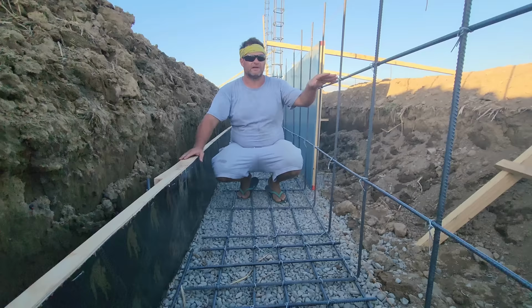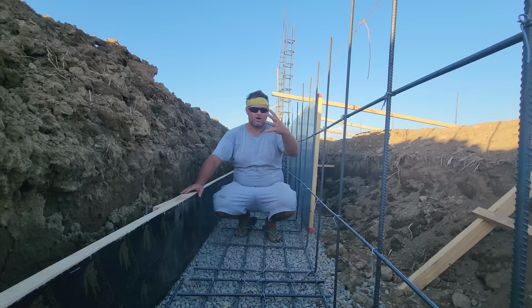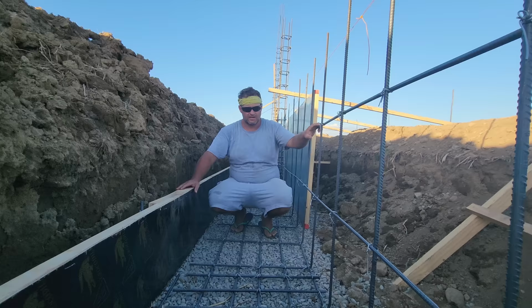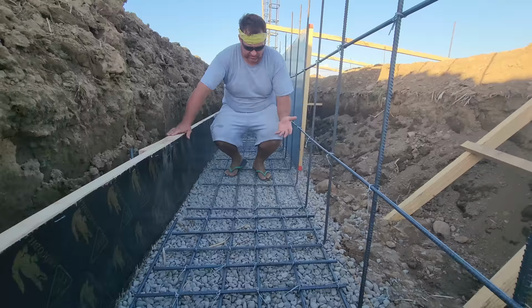The first thing that's gonna give out is a hollow block, but this concrete wall is gonna be high enough. It acts as a flood wall now. Yes. So any flood waters come in, we're somewhat protected initially instead of soaking through the hollow block. Okay. Because hollow block is kind of porous. It's very weak versus concrete, still porous, but now you can see the amount of metal that we use when we do retaining walls or foundations. It's a ton of metal. So you go down here all the way, they're doing a really good job.